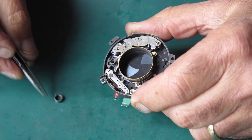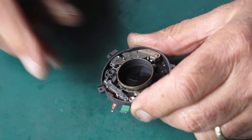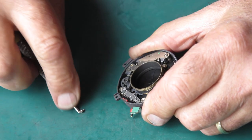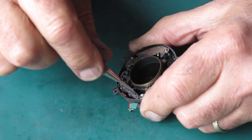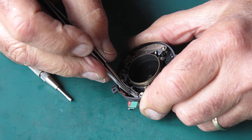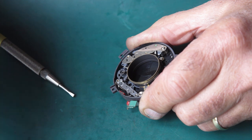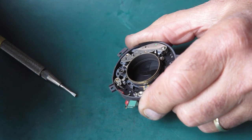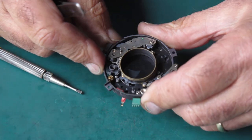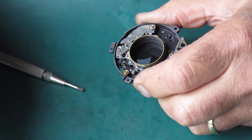Look at the state of that — that one looks very good, suspiciously good. Two screws here hold this plate in place. There's a return spring on here — I'm just going to unhook that so it doesn't fly everywhere. Take that plate off, take off the moving flash contact, and take the cam off.